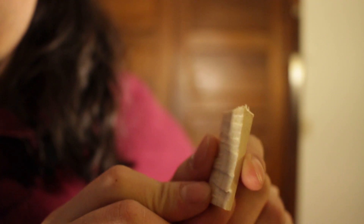With this axe I can't design the handle that way because the eye is very small, meaning the narrowest part of the handle would be too thin to be functional — it would probably just snap unless I used very hard wood. So I went into the garage and grabbed a small piece of pine I had lying around. This was a mistake — don't use pine, it's too soft. I cut a small wedge with the pine, seated it, and the head was still wobbly. Very disconcerting.